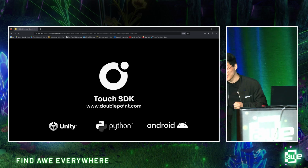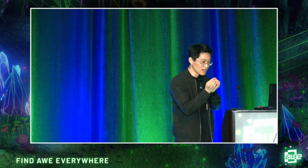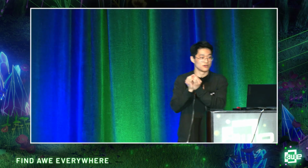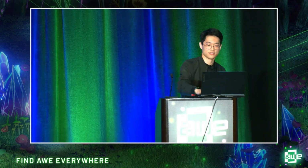And if you want to try out our evaluation kit, which is a bit more advanced, it comes with features like being able to try models of different sizes. So if you're an IMU provider, if you make IMUs and you have a computation unit in the IMU, you can ask us for kilobyte-sized models, and we will give you one. And also, we can give you models that output tap strength as well. So if you want to test light taps, meaning clicks, but then strong taps, meaning double clicks, for example. And also, we can output tap probability. So you can actually set the threshold for what is considered a tap or not. But for that, just ping me a message.